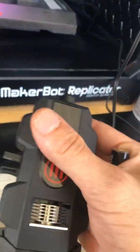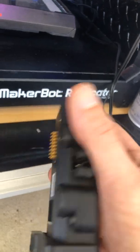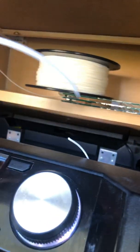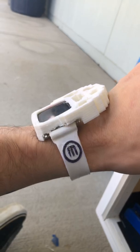The Smart Extruder Plus is a must on any of these printers - everything else is garbage, all the older ones are garbage. There's not a whole lot of modifications you can do to the Smart Extruder that I found actually work. The only one I found as far as actually modifying the extruder itself is the NinjaFlex or flexible filament modification. Basically you just take the four screws out, pull it apart carefully, and there's a little piece that guides the softer filament all the way down. It's an absolute must when you're printing with flex.